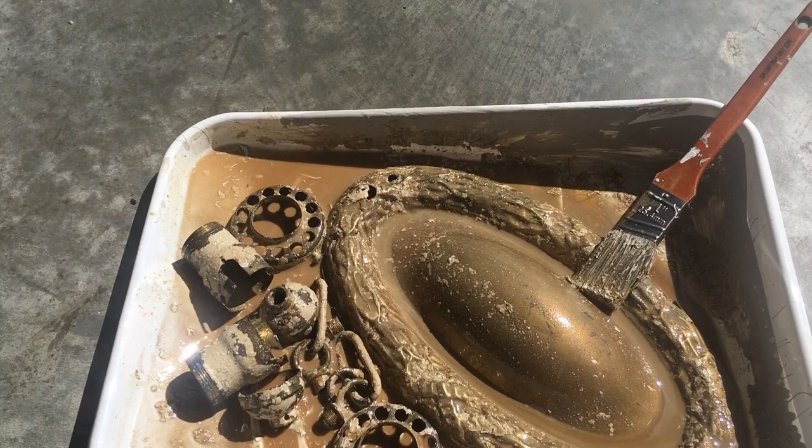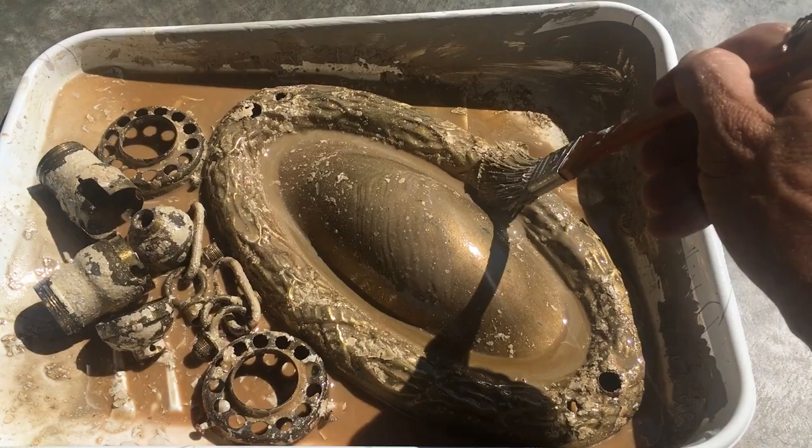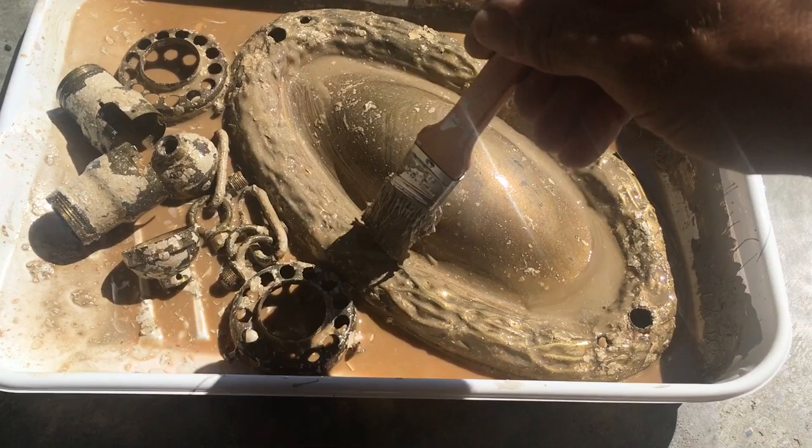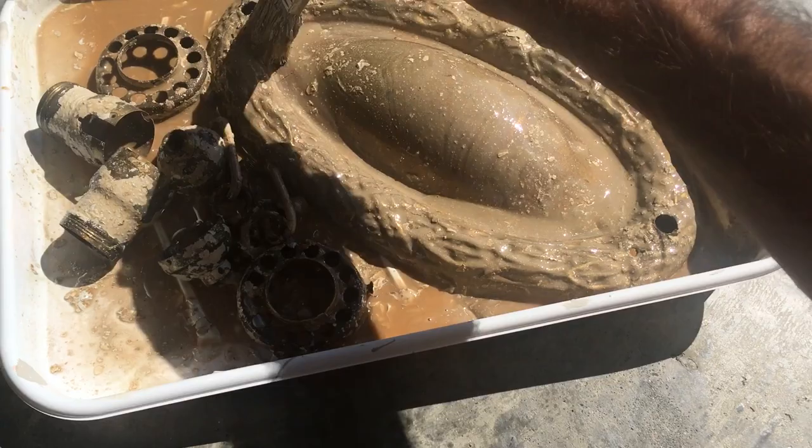We have stepped away for a few hours, and take a look at this bucket of mess, or pan of mess. But look, just taking the paintbrush, I'm able to wipe this paint right off. The key is, folks, let the stripper do its work. And this orange stripper takes much longer because it just does, and it's not as caustic. But it's only been a couple hours.